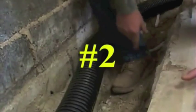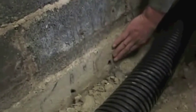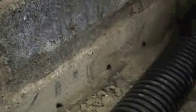This is all mold. You can see that the mortar joints in the block have not been drilled out. It's imperative that whenever you're drilling out weep holes, you get to the mortar joint. There's no weep hole in this mortar joint. They did not drill out every cell of every block, nor did they drill out the mortar joint.